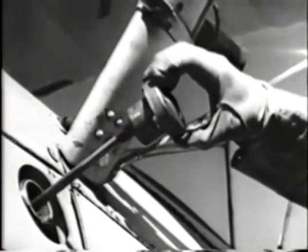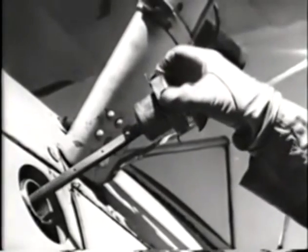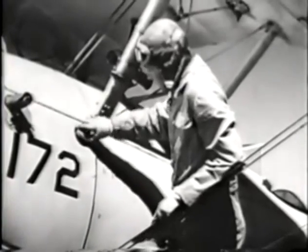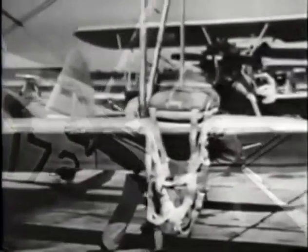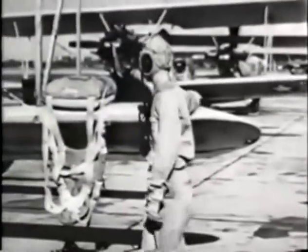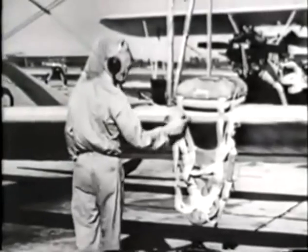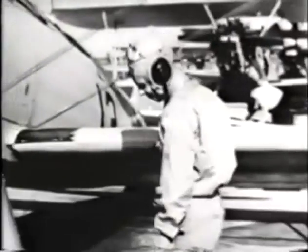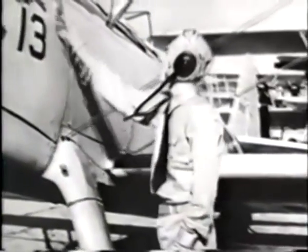Sometimes there's a metal dipstick attached to the inside of the oil cap. If not, you should be able to see the surface of the oil by looking carefully. If you can't see it, call the plane captain. Of course, if you're like our friend Mac here, maybe you have unlimited faith in your plane captain, which is all right up to a point. But for Mac, it's just too much bother to check everything. So he skips the oil tank. But one day, Mac, old boy, you'll be up there, solo maybe, and things will happen.